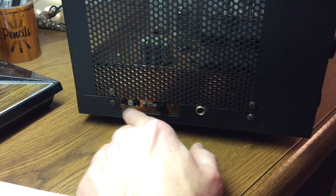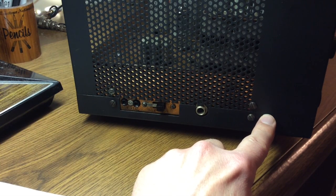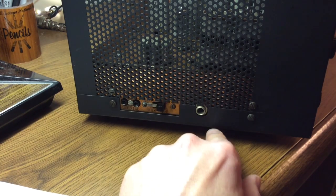On the side of the radio there's an optional crystal socket and a switch to select it. Any frequency range not covered on the front of the radio — you can cover between 3 and 30 MHz using an optional crystal if you wish. And then we have the headphone jack. I hope you enjoyed this video of the Drake 2C receiver — an excellent receiver. It's a triple conversion receiver, kind of a hybrid — partially tubes and partially transistors. It's just Drake equipment; it's hard to beat. Thanks for watching and 73.